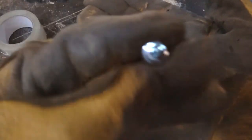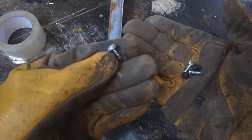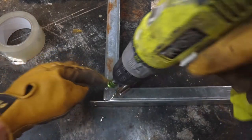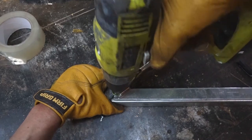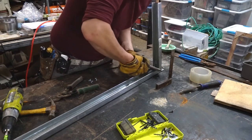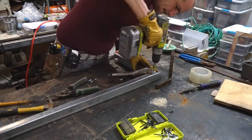These are all self-tapping screws. This one has a larger head, best for drywall applications. This has a smaller but thick head — both are self-tapping. This one is my favorite for this application; it's just really sharp and works great. I've used vice grips here because otherwise the metal is too flexible — you need to clamp or hold them together to pierce through them both. There's just too much flex at the end of that track. You can do that with a pair of channel locks or with your hand if necessary, especially if you're using the sharp black piercing screws.